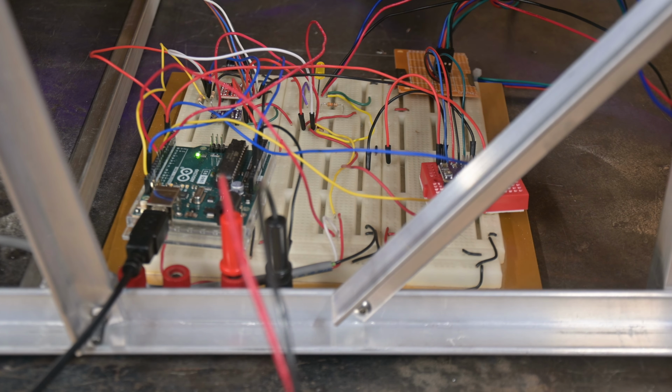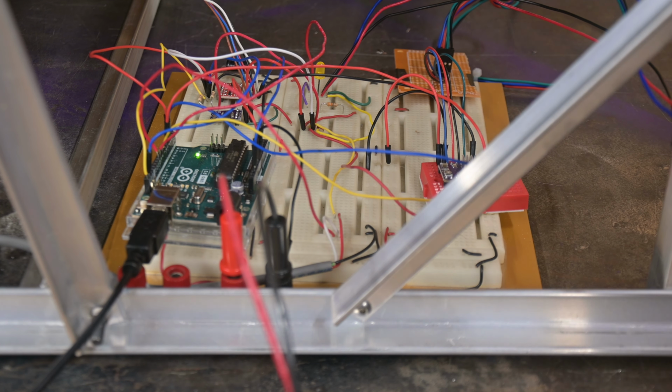One of the issues with the timing of these steppers is you need the speed, and what's critical with stepper motors is the winding inductance. So I got as low a winding inductance as I could find, and it's pretty fast. I'm going to run it pretty quick on here. I might be able to play around with the software settings and bring it down a little bit more, but right now it's running pretty fast.